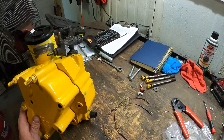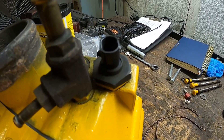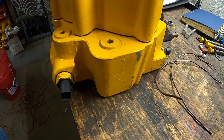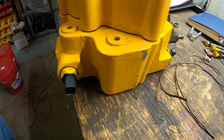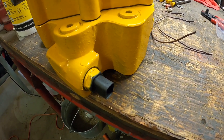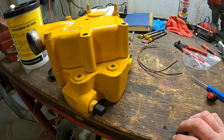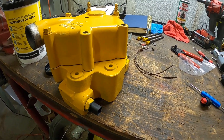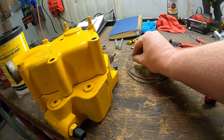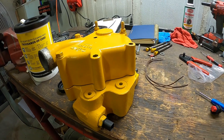Here's a little trick: when this is hanging on your engine you can't actually see that plug down there — it's very hard to get to. There's another temperature sensor up here. What was happening to mine is I was getting a check engine light and overheating. My gauge in the truck would jump from 188 — normal temperature — all the way up to 230 right away, start beeping and give warnings, and the fan would come on. But I'd look at the temperature gauge and it was showing fine, then the temperature would suddenly drop back down to 188. This gauge reads manually and goes directly to the gauge; the other sensor goes to your computer. If your temperature suddenly goes from 188 to 230 and right back down to 188, obviously there's a problem.